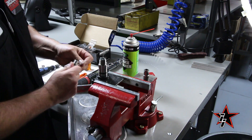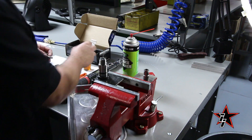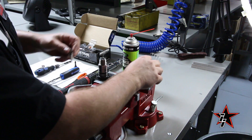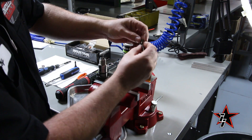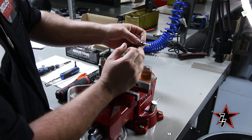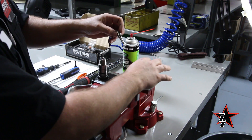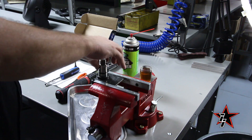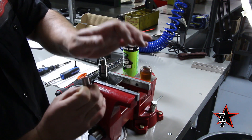Now I'm going to take my new nozzle. There are two places you need to oil up before installing the nozzle. One is right here on the shoulder — this is the surface that meets with the nozzle cap, and you want that to slide nicely. You don't want any chatter, so lubing it ensures you get a nice, even torque. I also like to oil the threads of the injector, keeping the mating surfaces themselves dry with no oil.